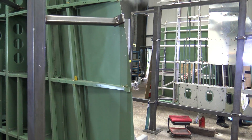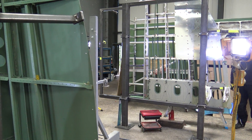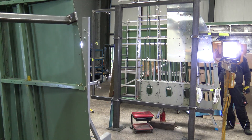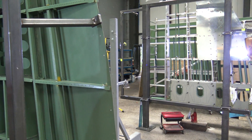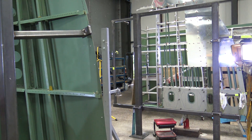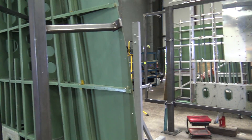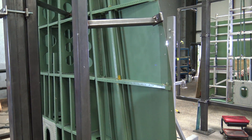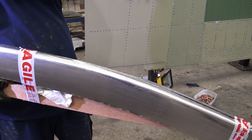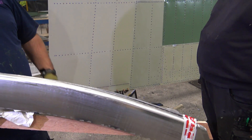The trailing edge — we've not got it yet. No, they're not putting the old one back on; they're waiting for the new one. It's been milled — it's an aluminium one — but they're looking for a company with a ten-foot capacity to do it. As for the leading edge, because that needed reworking, the lad's coming in to do that. We'll drill it off, but I think he's coming in to position it and get his contour, and then we'll do the hose and drill it off.